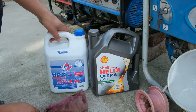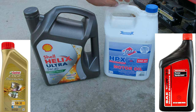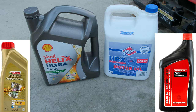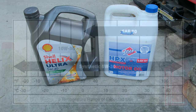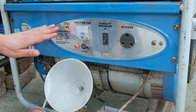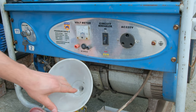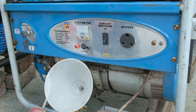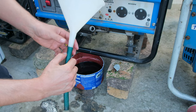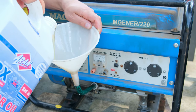I now need to select the correct oil. Please consult your manufacturer's guidelines for the type of oil. The generator I'm working with requires an SAE 30 oil. Some people prefer to put high performance oils in. While the generator is on a horizontal surface, I fill up the oil tank using the funnel. You know the oil has reached its maximum when it starts to drip out. On some smaller generators it's easier to use a pipe so the oil doesn't spill out of the funnel.